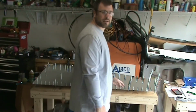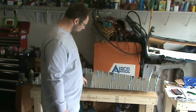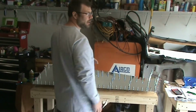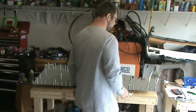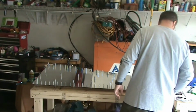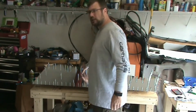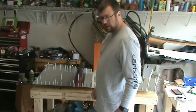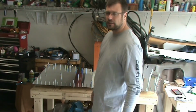You might notice I'm using a lot of clecos on this trailing edge. You're supposed to start in the middle of the rudder and travel outward and actually cleco every hole. So during this step, even if you go with minimal clecos on the rest of the skin, you're going to need about 200 clecos to do this probably.